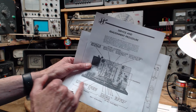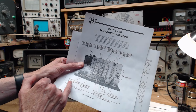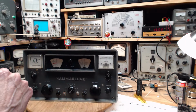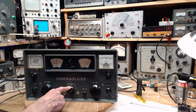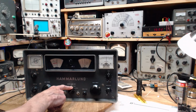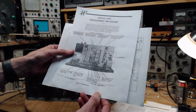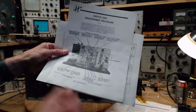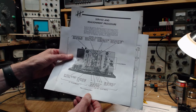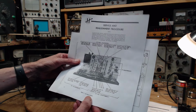Bottom slug adjust at 1.65 megacycles. Well, the place you find 1.65 megacycles is actually on the next band up here, not on the broadcast band. Wow, they really think you're going to think. The engineer who wrote this, the guys who developed this, they thought, well, the people reading this are going to think it through. Don't worry. Well, holy smokes. You can make a ton of mistakes here.